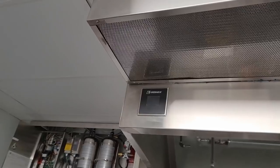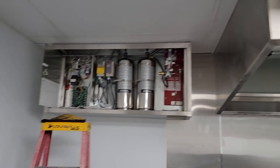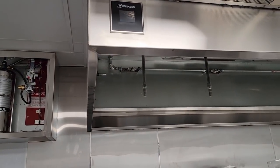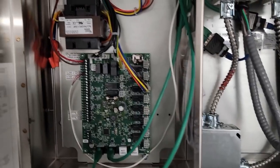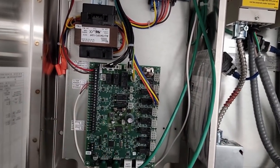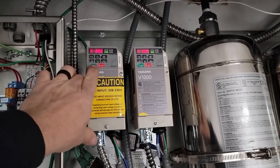Let's see what we got now. The 'call' means calibration or communications. Still have no display up there on top and it's still not doing anything. I need to go back up on the roof — I know I turned it on. Let's make sure we got power to this transformer, because I have a feeling it goes to this board, and this is obviously where communication starts.